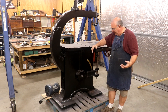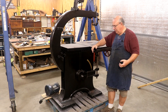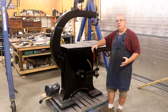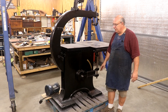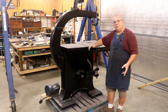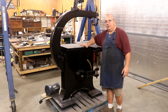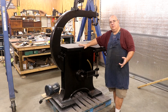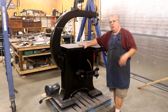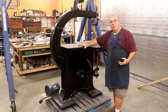There are a few little things that I'm helping him out on as we go, and today we're going to be making a project related to that. I'm going to be making a base for this saw to sit on. The biggest reason I'm building a base is this machine was built in the early 1900s. It was originally flat belt driven from an overhead line shaft, back before the days of electric motors. We're putting a motor on it and I need a motor mount.